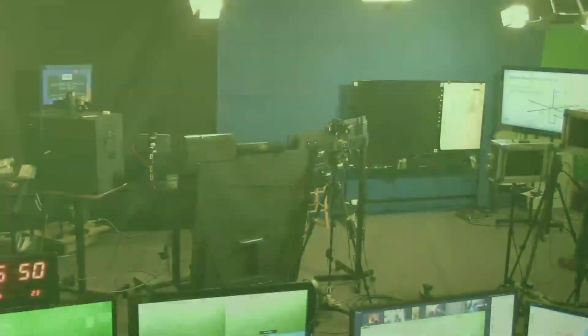All right. There is something, though, that you can do to shorten this antenna, and that's, let me put my meter stick away. If you take this antenna, so this is half wavelength, but we take the bottom and we bend it. Now it's only a quarter of a wavelength tall. And it's got this going out over here, which we call a radial. And normally you have a series of radials that go 360 degrees around a quarter wave vertical antenna. Remember I said I put up a DX Commander vertical antenna recently? That's essentially what that is. It's a quarter wavelength at the particular frequency of interest with a series of radials like this that make it go around. So let's head on back over here.